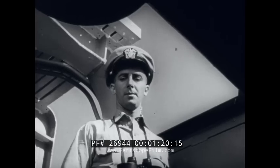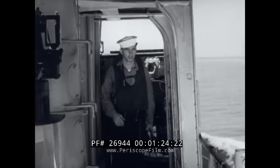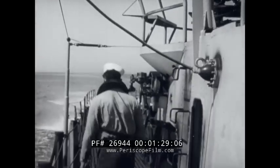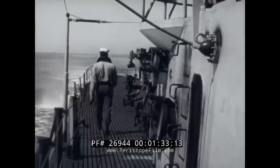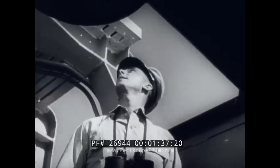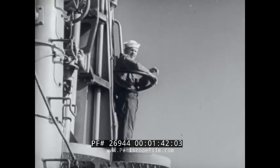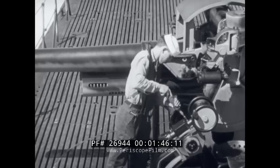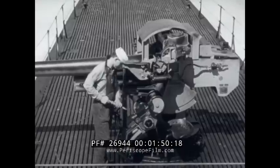But here's a different story. The gunner's mate wants to come up to grease the deck gun. Permission granted. All armament must be kept in top shape, and it must be done while the gunner's mate is off watch. He's wearing his life jacket, and the OD knows that as a qualified submariner, he has been thoroughly indoctrinated in safety practices. That's quite right to instruct a lookout to keep one eye on the gunner's mate. But he should have insisted that a second man tend a safety line to the bridge. And he should have notified the captain that a man was going down on deck.